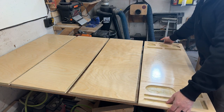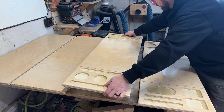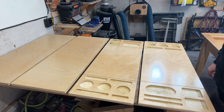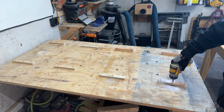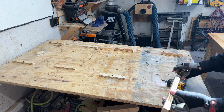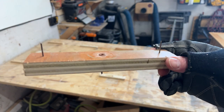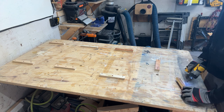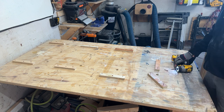Speaking of frustrating, now three coats of poly to the entire thing — all remaining surfaces, two sides of the leaves. To save time, I made some little standoffs on scrap pieces of ply using nails where I cut the heads off. These are actually from a prior project — I keep these around, they're very handy. Just screw them into the table when I need them, and unscrew them when I'm back on the shelf until the next time I have to paint two sides of something.